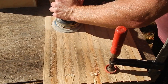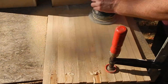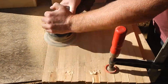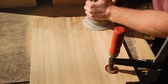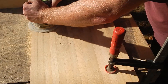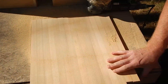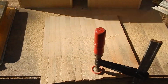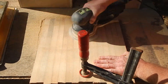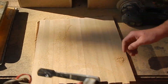For a curved surface you'd want to leave extra thickness, because as you round things off the effective thickness of the strips becomes less — like staves in a barrel or something like that. And I'm grinding off all that extra Gorilla Glue, and it does leave a really nice surface. I've probably lost about half a millimeter of thickness here, if that. And I'm going to leave a rough 60 grit finish on it.